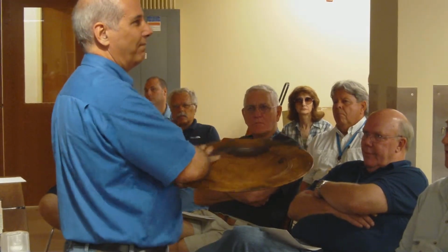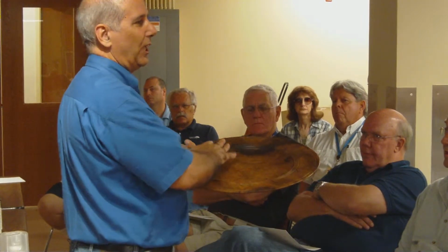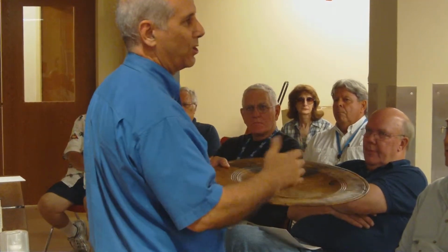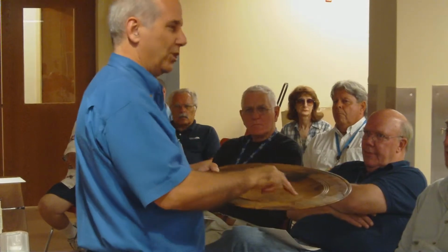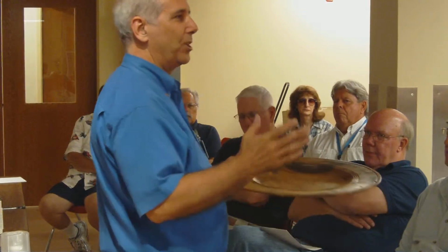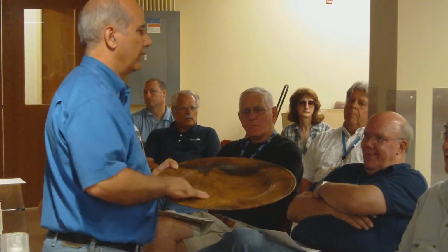And you may have to do that four or five times over the next hour or so, until one of two things happens: it starts to cure, or you get enough of it out. If you don't do that, you see a little shiny spot, or problems in the next layer. It will seep out in ways you can't imagine, and you never realize how many pores are in that wood.